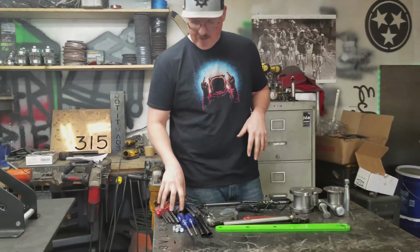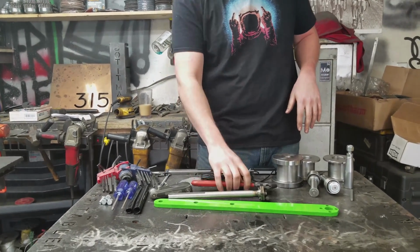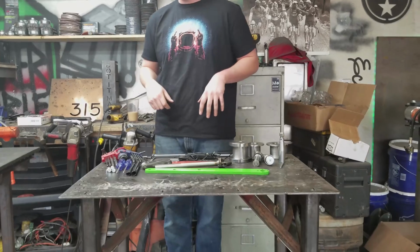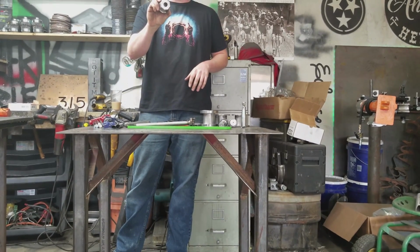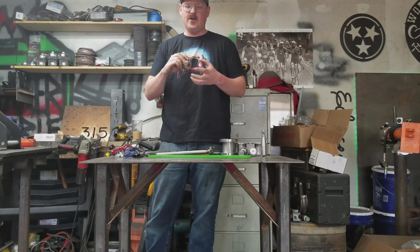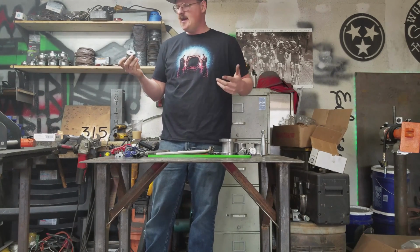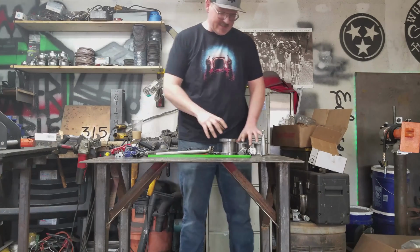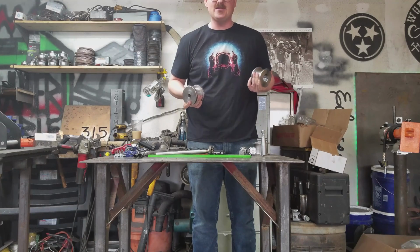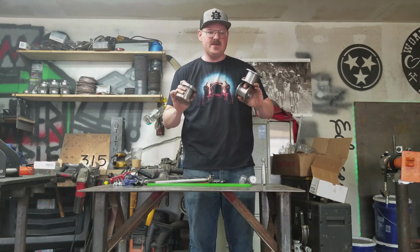So right over here we've got our Allen wrenches, a couple screwdrivers, and a crescent wrench for the odds and ends. We are initially setting this up for manual crank. We're going to crank everything by hand. They do make a kit where you can weld one of these onto the drive shaft, and this will let you hook up an electric pipe threader from Harbor Freight or the local hardware store and drive the thing with a motor instead of your arm. But I don't have one of those yet, so we're just going to start with the hand crank. Basically you get one free die, so we got the die that matches our job, and it's a 2-inch square die, and the die consists of 3 of these rollers.